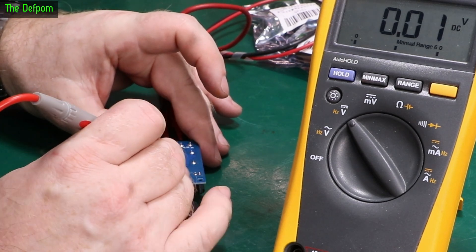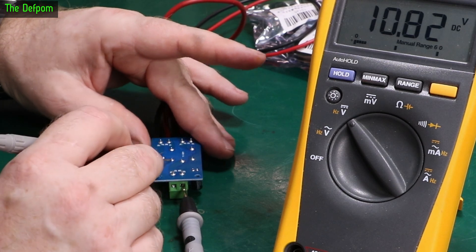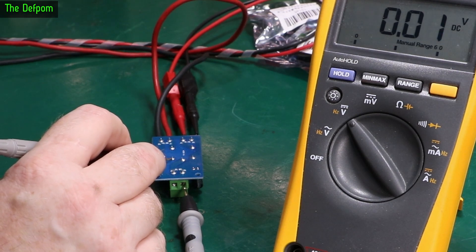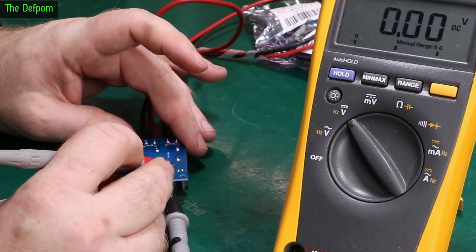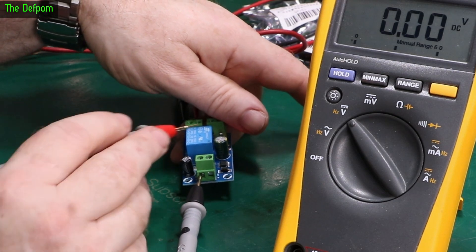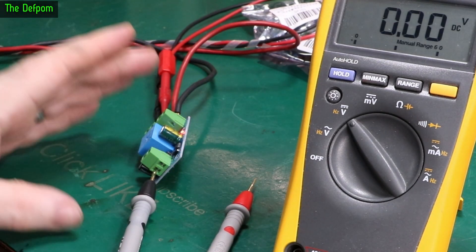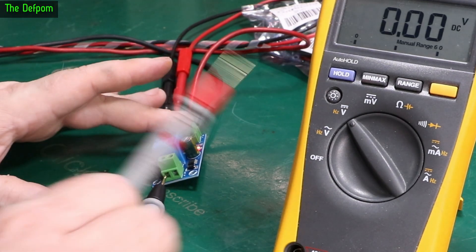The main input comes in through a diode for polarity protection, and there's a big capacitor here at 11.5 volts across the main DC input, obviously powering the circuitry. When this capacitor discharges it'll be sliding down the rest of the circuit. The coil connection is running at 10.8 volts, and if I pull this you see it gradually drops — that's the capacitor discharging. So that's that capacitor doing the relay coil, which causes the relay to be slower to turn off. When you've got a supply like this you want a quick changeover — a slow turnoff could cause a dropout or brownout on your device.